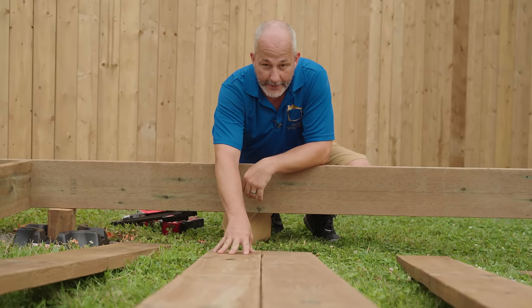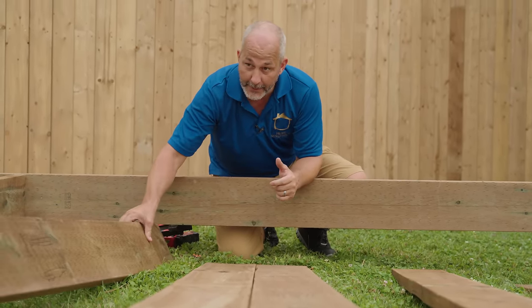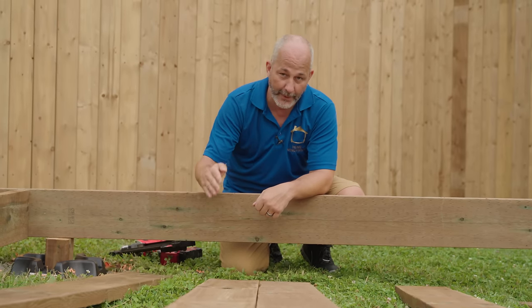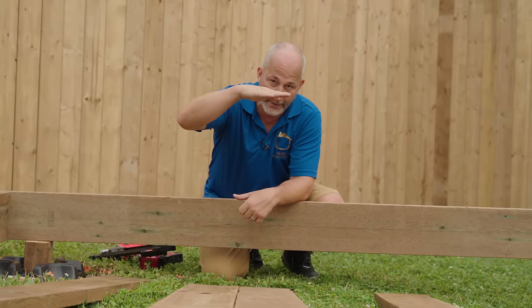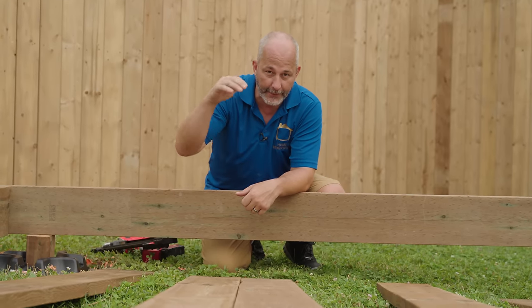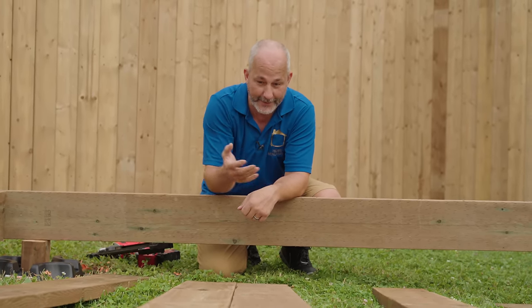Here's what we're looking at — two floor joists, and I'm going to demonstrate crown. What we want to do is install the crown up — in an exaggerated world it means it's like a rainbow, because then as weight gets put on it, it flattens out. If you go the other way and it's like a bowl, the weight makes it even worse. Dimensional lumber is never a perfect surface — it's not an engineered floor joist — so you've got to try to work with the curves, because you don't want one up and one down, which makes it really hard to get your sheet goods installed without screws and nails popping over time.